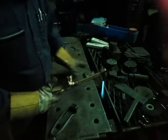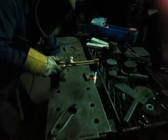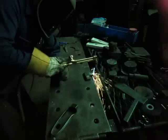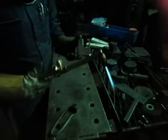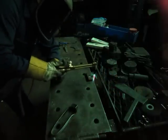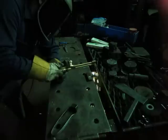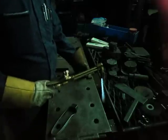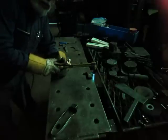What's there pops right off. We can do this even farther away — one side out. When the seam's being preheated, it does help some. Fair little slag. You can do it close as well — a little finer curve, a cleaner cut. I generally like to see at least a quarter, if not three-eighths, holdoff, just to keep my tip from getting messed up.